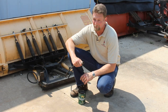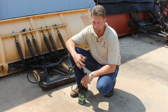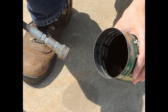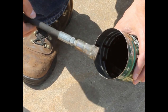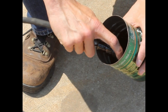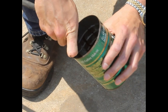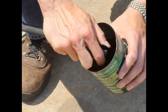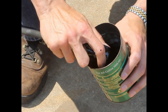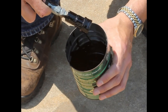Another area that the Lubrocele can save a tremendous amount of headaches is with these female hydraulic couplings. I've seen these things packed with grease and baggies and oil and rags and all kinds of things to try to keep them from rusting and seizing up during the summer time. If you'll just take this female hydraulic coupling and dip it down in a coffee can with some Lubrocele in it like this and move it back and forth a time or two while it's wet, that'll keep that coupling from seizing up. Get it good and coated, get it good and moved around. That Lubrocele will migrate down in there and it'll completely keep that coupling from seizing up. Hang that thing up and let it dry and you're finished.